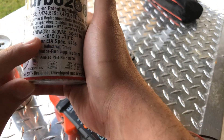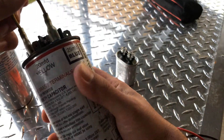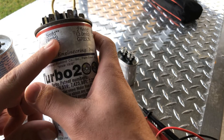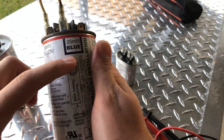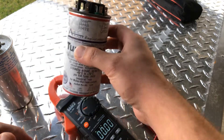This is a 370 or 440, and it has this jumper that'll go from different posts to make different microfarads. So if you needed a 45, you got a 20 and a 25, you make a jumper. And it's kind of universal — you can use it on whatever you want.